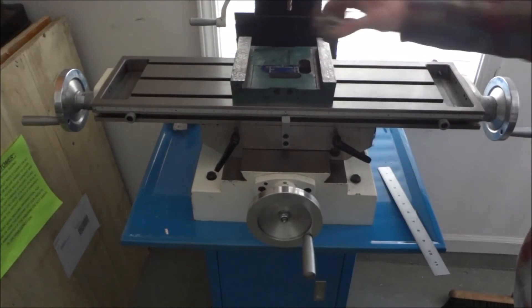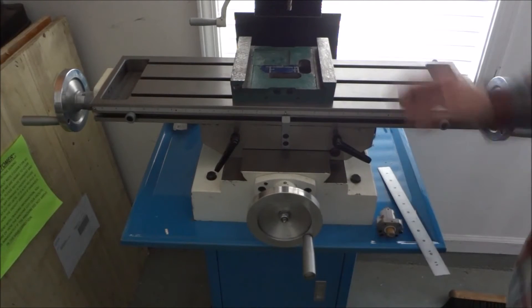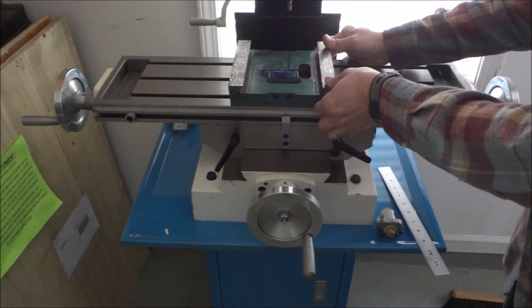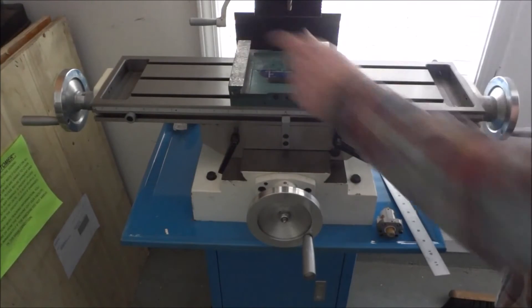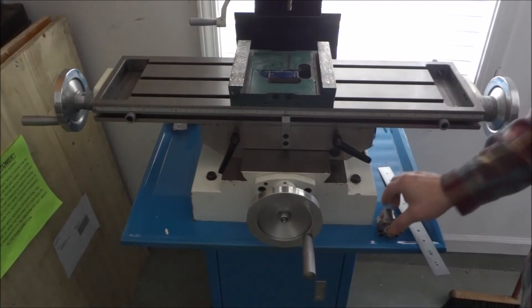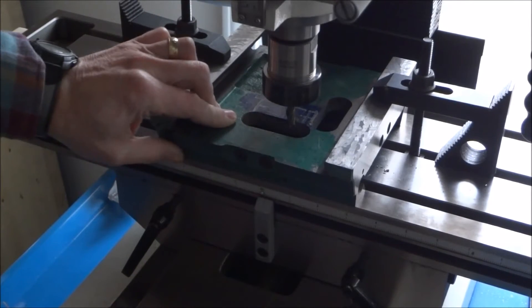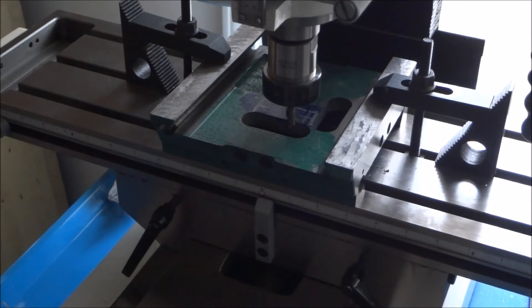He asked me to mill this out for him. I was a little hesitant — it's basically straight-through milling of this pocket — but I figured I'd give it a shot. I haven't done any manual milling, actually haven't done any milling on the Precision Matthews yet. I'm going to get this clamped and squared up. I've got a 5/16 inch end mill in here and I'll go in and mill this pocket out until the ball nut drops through. I've got it squared up and I'm just going to do an outline of where I want to take off, double-check it, then go a little deeper.